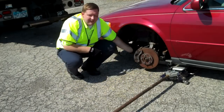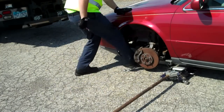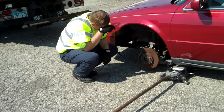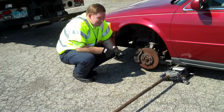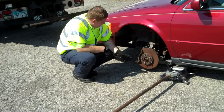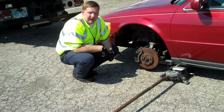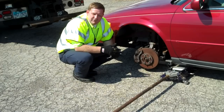Now the fourth wheel loader is completely attached to the vehicle — very solid, can't even kick it out of the way. Take your excess chain, set it on top of the shims so it doesn't get caught on anything, and you're ready to load the vehicle. The fourth wheel loader has one-inch axles and it's been tested up to five tons before it fails. We've also added three mini J-hook holes on the front and the rear of the unit to attach to your bridle so you can pull it up onto the bed easier.